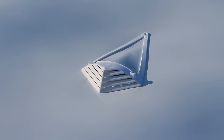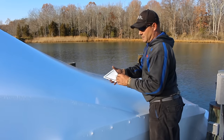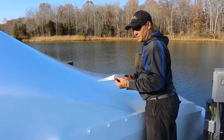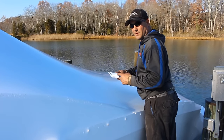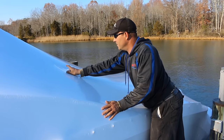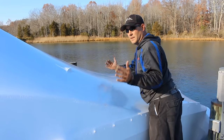What we're installing now is called a stealth vent. These are self-piercing vents that go into the shrink wrap, and the reason we like these vents is because they're kind of bird-proof. There are other ways, cheaper ways of doing it, but from a professional standpoint, to protect the boat, get air inside of it, and keep out birds — that's the way we want to do our jobs. We're going to pierce it, slide it up in place, and because this is a 26-foot boat, we're going to have six vents, three on each side of the boat, to allow cross ventilation.